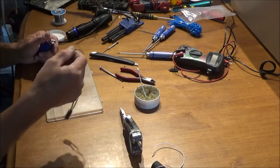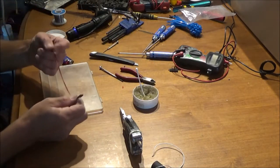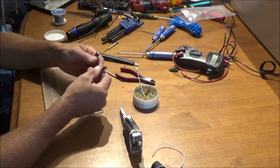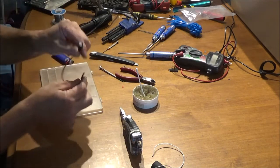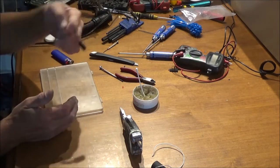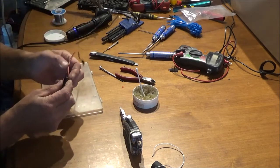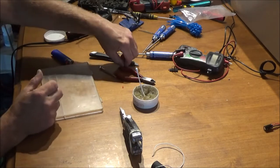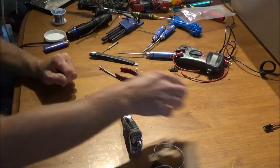Voilà — there's your glitch buster. I went with a long wire because you don't know how much space you've got. In a Traxxas machine you've got the receiver boxes and you've got to fish it through, so extra length lets you take some sticky tape or a tie strap and hook it to another cable in your truck and let it dangle — it doesn't matter. Make sure you heat shrink tube the contacts so nothing shorts. If you don't have shrink tube, electrical tape works, or even coat it in hot glue — that actually works great.